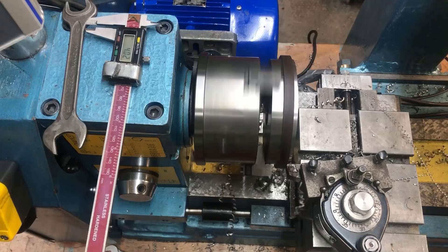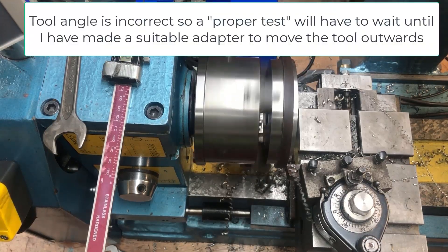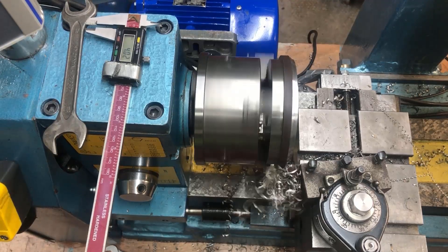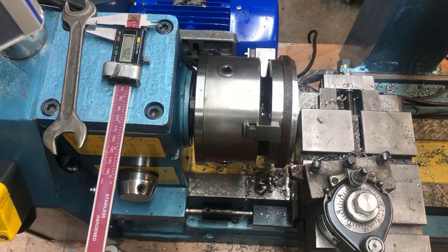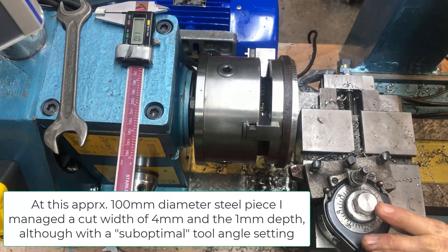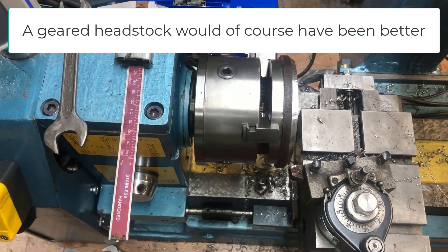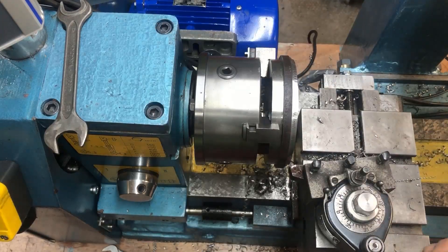There's a tendency to chatter. It might be too tough, so a little bit more shallow. That seemed to perform much better. So around one millimeter depth of cut with four millimeters width of cut — I think that's okay. That tells us something about the performance of the machine, from this kind of heavy turning on a large diameter piece to the earlier tests of small diameter at high speeds.